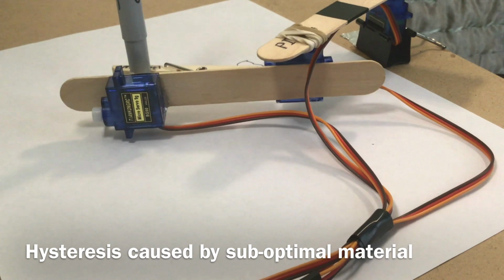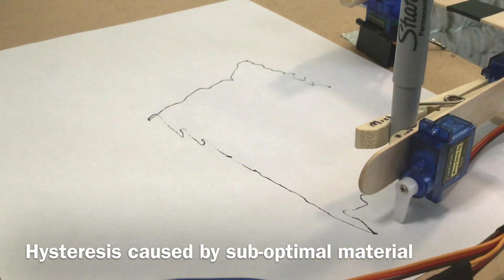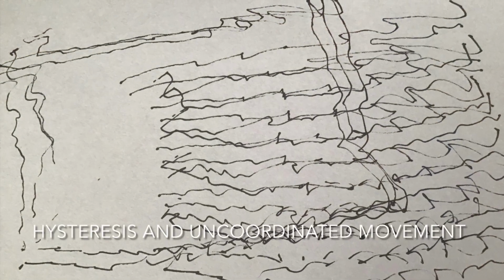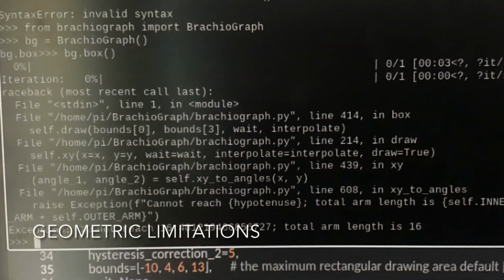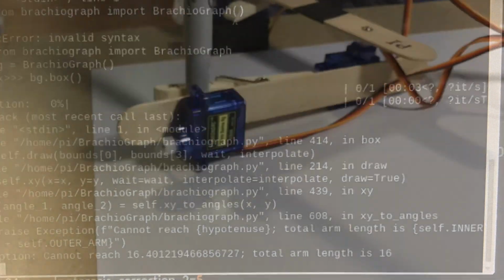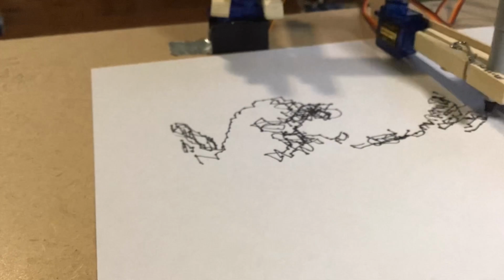The length of the arms, at 8 cm each, limits the maximum reach to 16 cm, causing undesired marks and smaller prints. The default geometry of the brachiograph and orientations of components could also yield marks or rigid motions. Finally, time is a constraint as the project needs to be completed in a short time. This also makes information harvesting and new skill acquisition challenging.